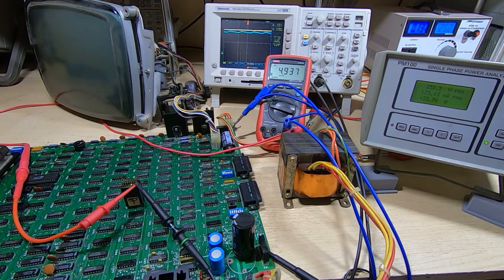Okay, the voltage is looking good so far. Power's up slightly higher than it was, about 1/4 of a watt, but that's probably a good thing. It means we're absorbing a bit more power and getting better smoothing. And power factor is just under 0.8, which is very good. You probably can't see the screen, but it does now function. As I said, I did carry out some repairs previously, and it does appear to be working.